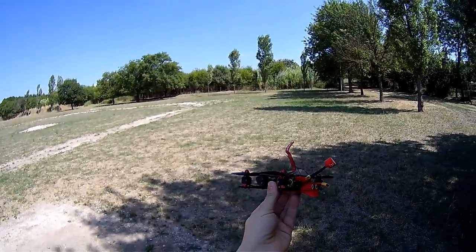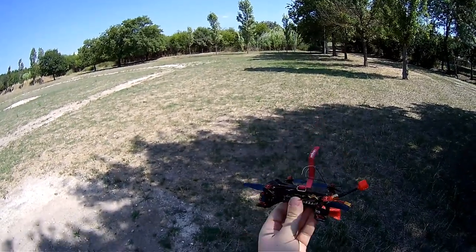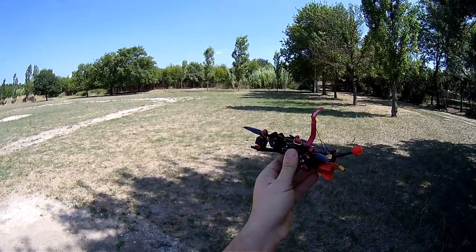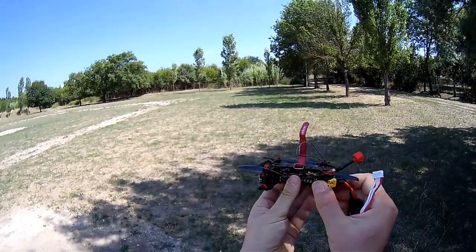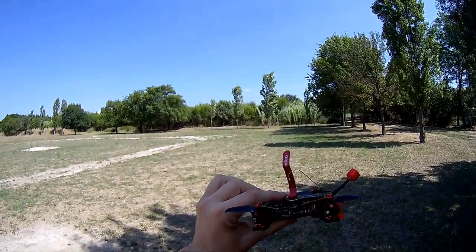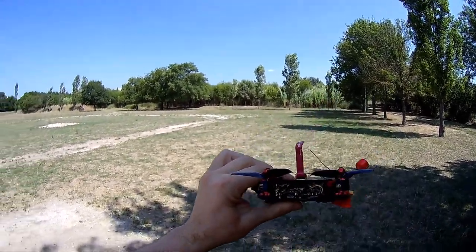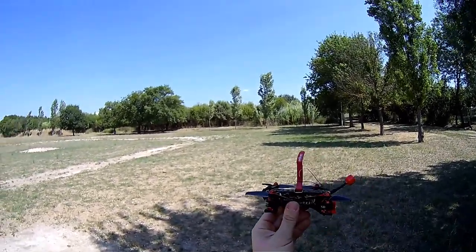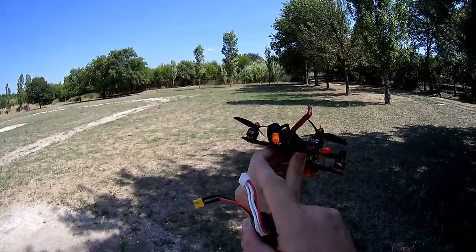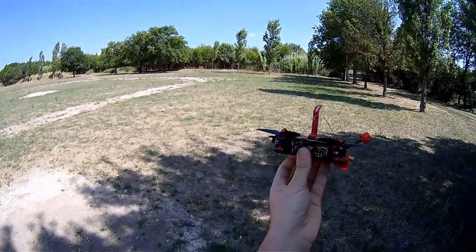in order also to increase the dampening effect, okay, because this built-in gyro, this MPU 6000, is super sensitive to transmitted vibration. So I am not sure that the best location of this flight controller was on top, maybe it was more on the bottom. I'm not sure you can install it, maybe there is some free room, okay. What I regret is the absence of a UART 3 RX soft serial pin in order to plug the RunCam Split Mini into the flight controller in order to control the video triggering on it.